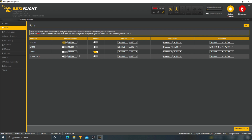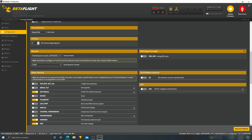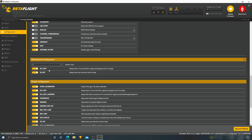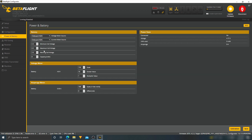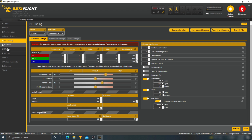Going into Ports — we're going to disable the one we don't need; we don't have any GPS or barometrics connected. The craft name is Smart 35 — I'll change it to my name as usual. Camera angle we can't change. We have Crossfire on the serial port, which is good. We don't have telemetry enabled — that's fine. No LED display — that's fine. Signal loss will trigger a beep, which is good. Power and battery settings we're not going to touch. We're using LiPo batteries, that's all good. We're not going to tune this quad at all — everything here is fine and we want to preserve the factory settings.